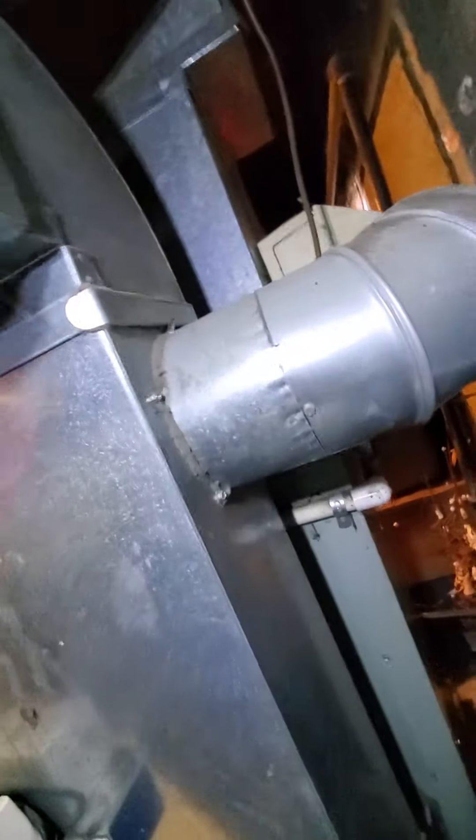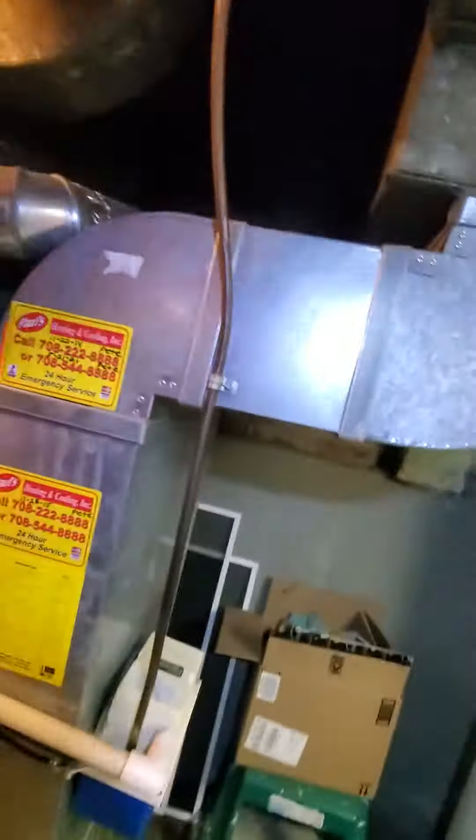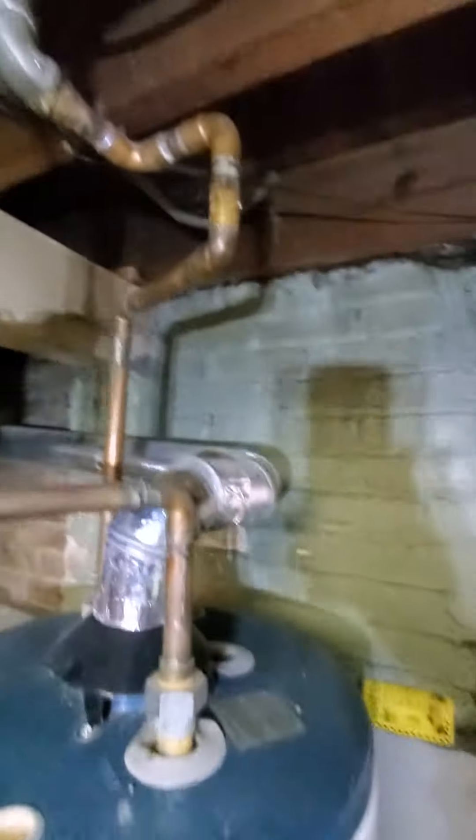Your humidifier is back here — it is a bypass type. The homeowner definitely wants to delete this for now. If we do add a humidifier I'll let you know, but as of right now we are deleting this. There was a little bit of rain water that's snuck in on the floor, but nothing too concerning. That humidifier has a saddle valve plugged into a galvanized pipe, but there's copper piping here if we need to tap into that, which would be better.